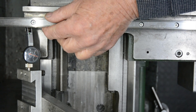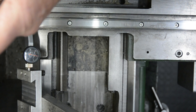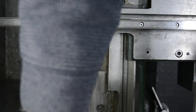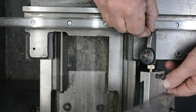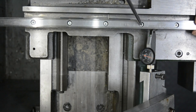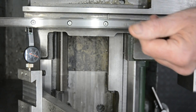I'm going to just pull that back a tiny bit and tighten up this bolt — that's spot on zero at that end and that's fixed down fairly firmly, so that shouldn't move too much. Come back to this side — we're about a thou too much. I'll just pull back there and tighten on this one. With a bit of luck we'll be more or less spot on. About half a thou too much — bring that back out a smidgen.